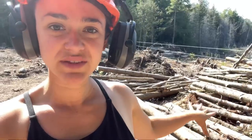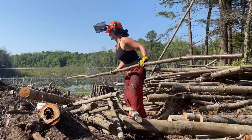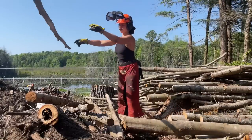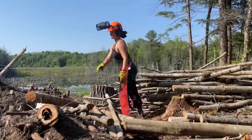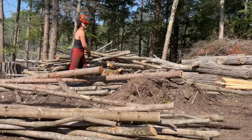To start I'm going to go through this pile and see which ones would be best for the posts, and then I'm going to sort them to see which ones would be best to go horizontal between the posts. In this pile I have grand firs, I have maples, and I have hemlocks. Hemlocks are not a good option because they rot really easily when exposed to water. I also have cedars in another pile which I know are the best option — it's just some of them aren't necessarily the right size.